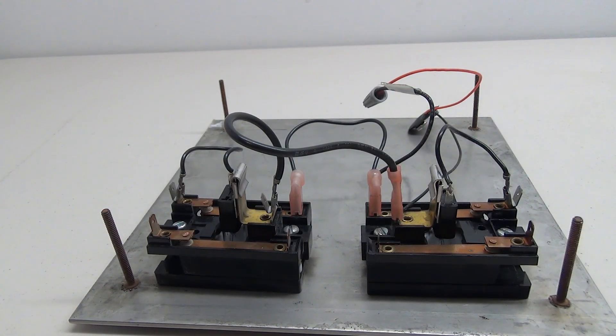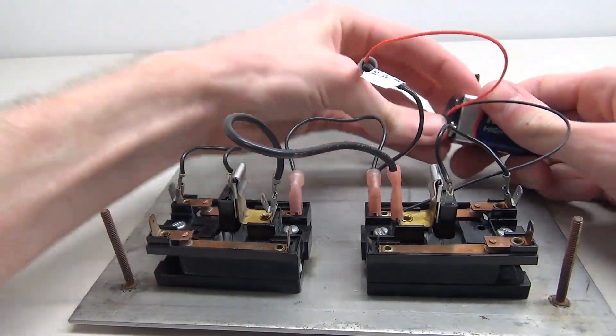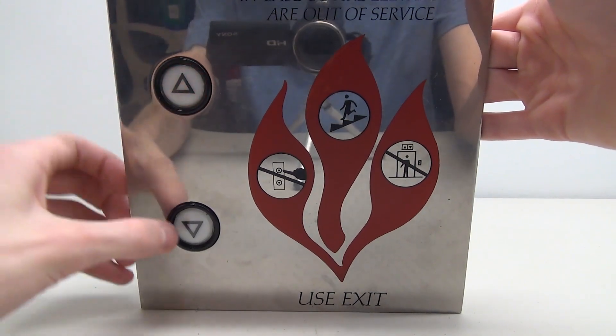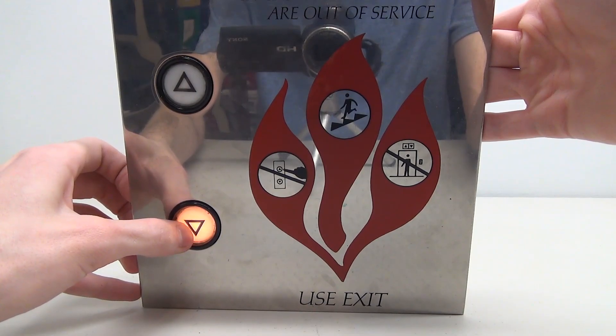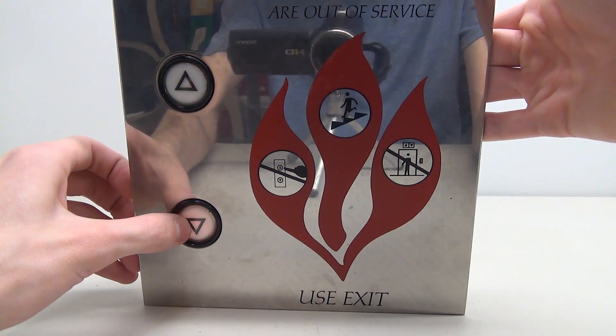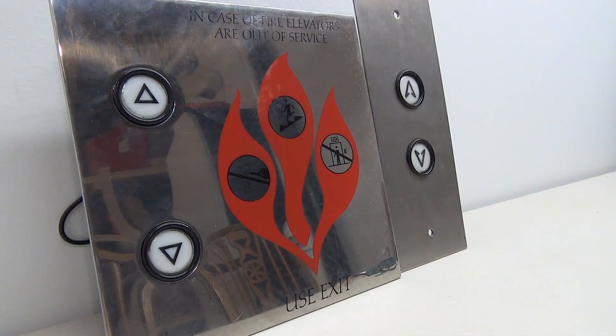That's another super simple, easy way to do it. All that's left is to hook up your battery. Now if we look at the front of the button and give them a press — look at that, they light up and they look really nice! That's why I love incandescent: this is exactly how this button was supposed to look, with incandescents, and that's how I like to keep it. That's going to conclude this video on how to wire a Dover traditional. Hope you guys learned something. If you have any questions, comments, or ideas, stick them down in the comments below. Thank you for watching and we'll see you in the next one.